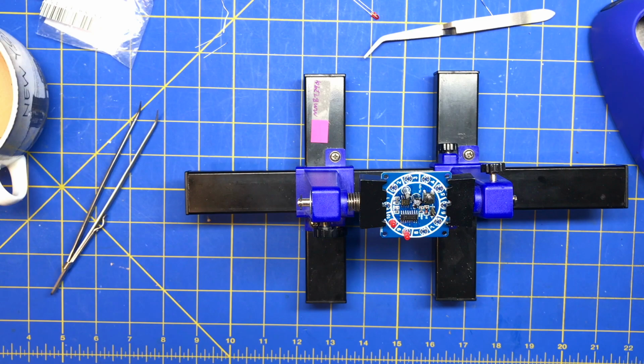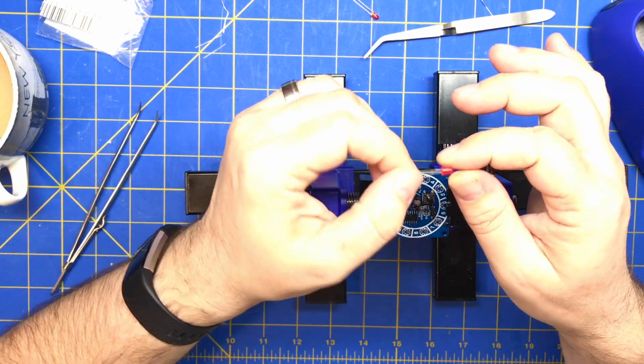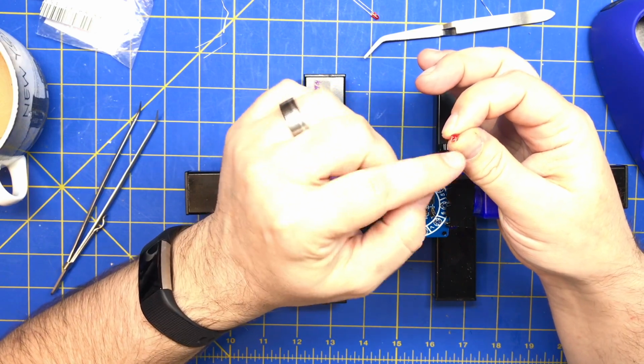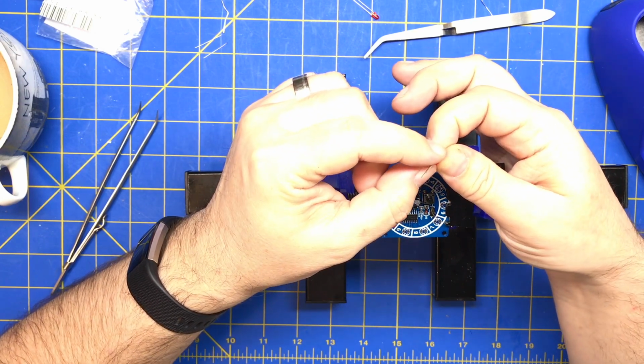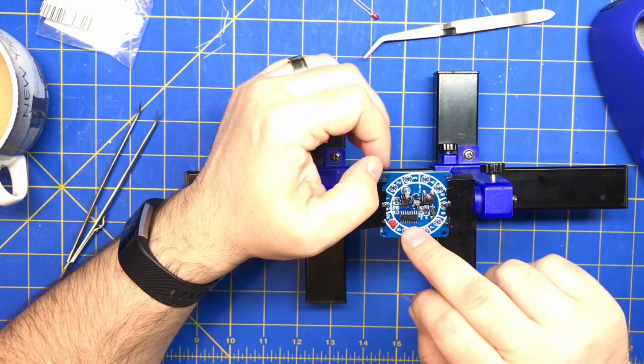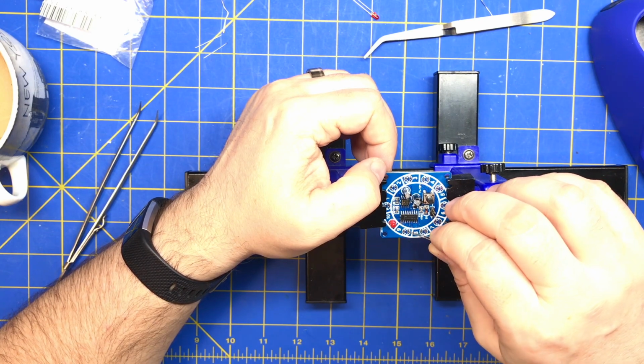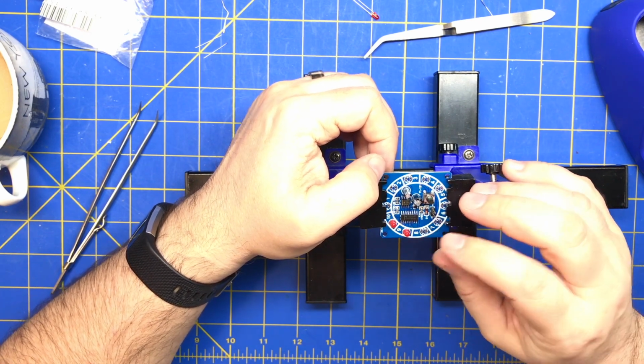Right, so the short leg is the cathode, which is negative, which is the same as the ground edge. So the ground edge, the side that's flat. When I say flat, the bottom of the LED is a circle, but this side over here is flat, and this is the short lead. And so the flat side is the same as the chopped side with the arrow with the line across it. So we can go ahead and put these all in the right way.